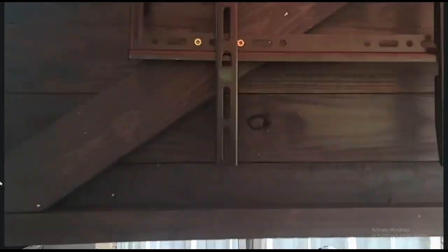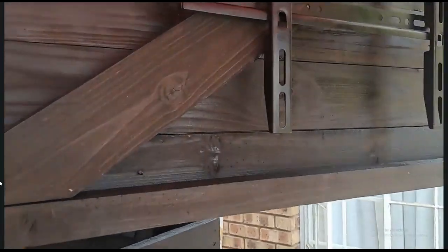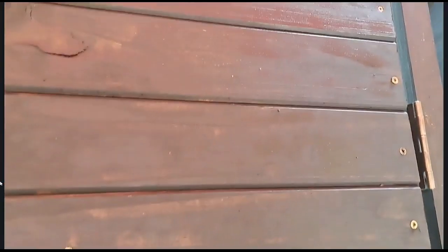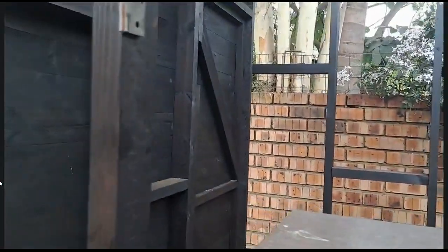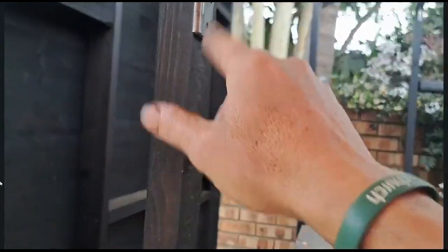There's a TV bracket in there — I'm going to put my display up there, and that's the reason why this door is a bit bigger than that one. That's also why I chose these hinges, and I also have a third hinge in there. The door was fitting fine but the moment I put the hinge in it created a gap and this door didn't fit anymore, so I actually had to cut this door smaller again just to compensate for the hinge.